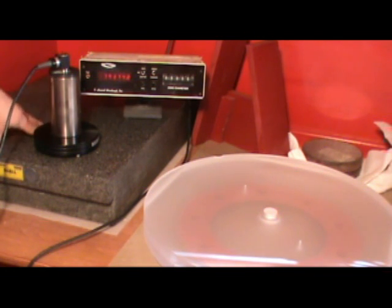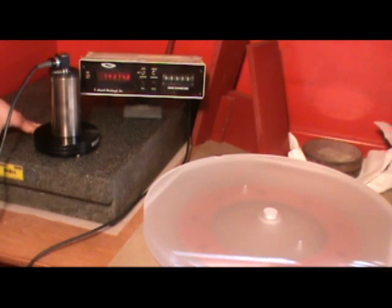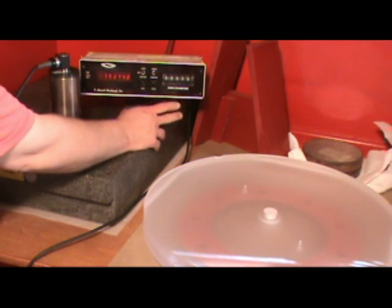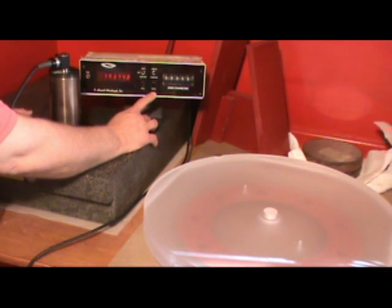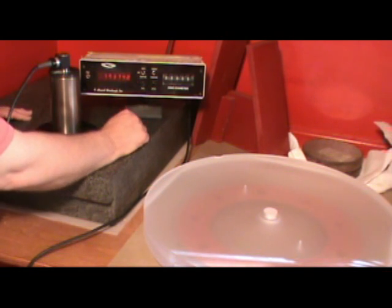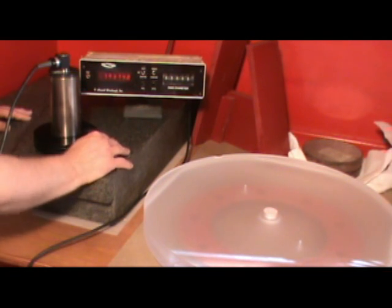So to do this, I have a spherometer station here that I've built. I have an area here where I can put the piece that's under test. This is a 20-inch quartz mirror f4.5 that I'm working on right now. And then this is the computer controller for my spherometer. This box is the control unit. On the box, I can set the size of the spherometer ring that I'm using. I can zero the ring. I can check the sagitta. I can set it up to whether I'm using inches or millimeters or diopters. And then the computer reads out directly the radius of curvature of the mirror on this readout.